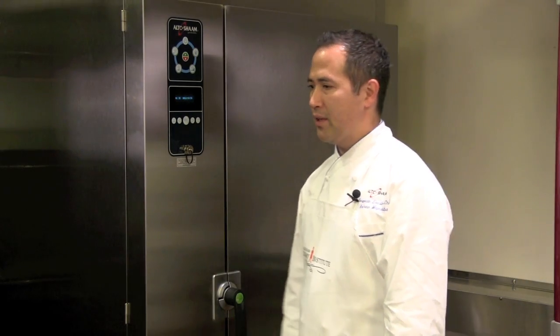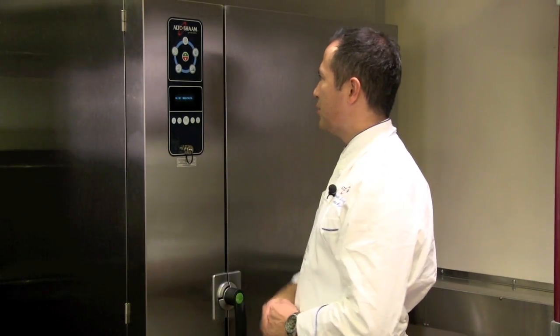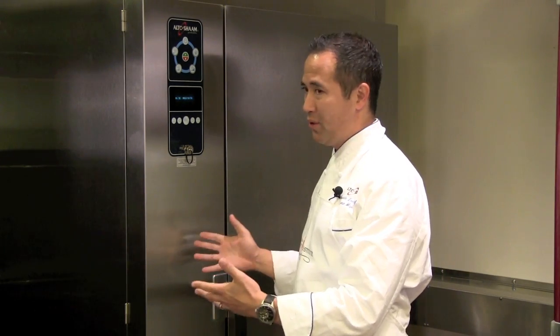Okay, first things first, let's go back to that first method I was telling you about. Most kitchens who have quick chillers generally run the chiller at a cold temperature throughout the workday, and they put food in, and when it's cold they take it out, and they're putting shifts of foods or waves of food, not always putting an entire cart full of food in here. So almost think of it as your convection oven that you turn on in the morning and leave it on all day. You put food in and you take it out just as you go along. So I'm going to show you the very simplest way to do that.